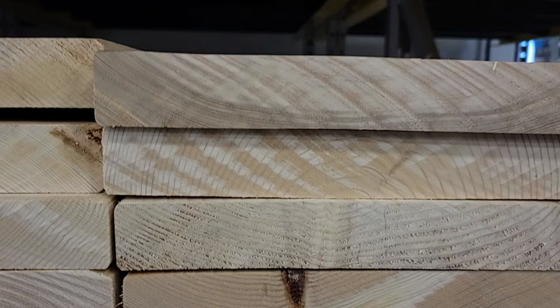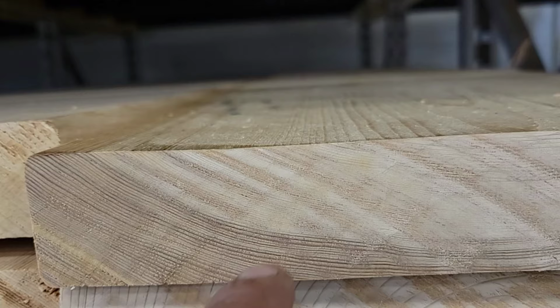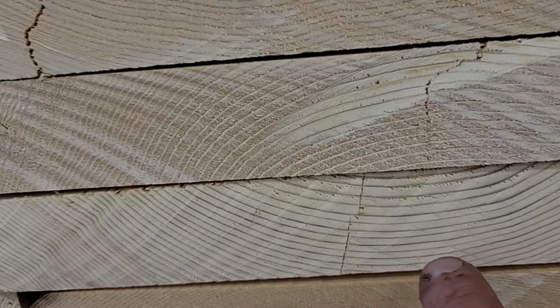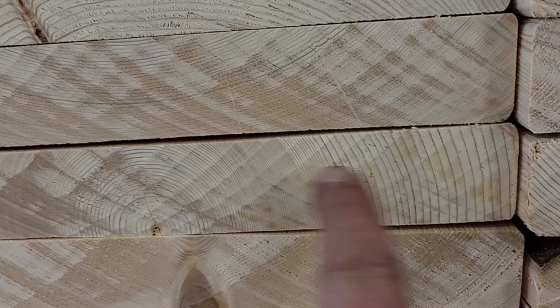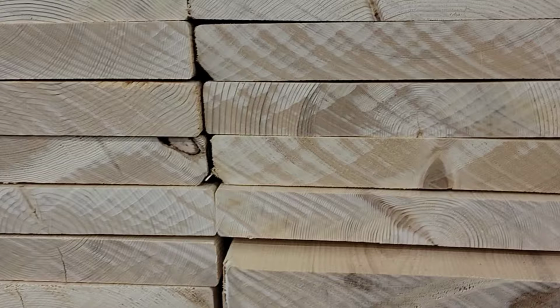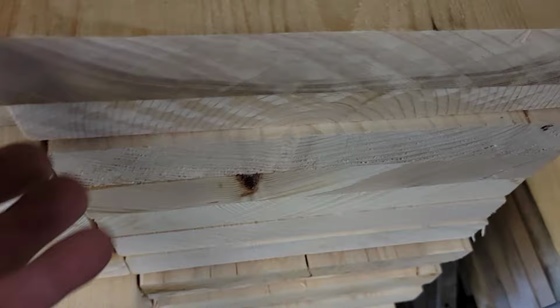So don't be fooled by the saw cuts on the end grain and the true grain. See, they go both ways there. Always look through the saw cuts at the grain. There's face grain. For the shou sugi ban, you don't want edge grain, see how it's going up and down there? You're just going to get straight lines when you do it. If you carve through face grain, you'd be carving into the tree, so you're carving through layers.